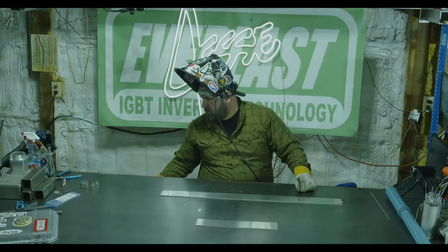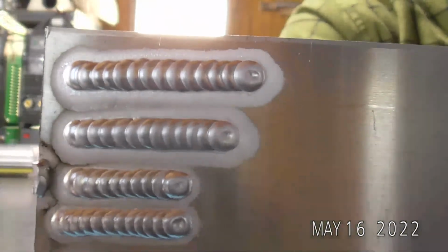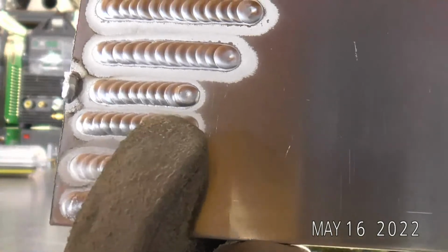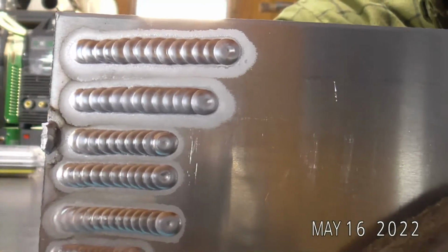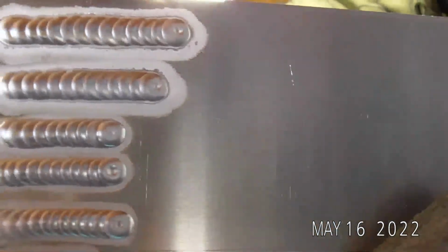So you can see how wide the etching is right off the bat. We're running the same exact settings. The only change is we went up in gas flow by about 2.5 times. So we can get back up on the up close cam. So you can see, I should have ran those a little bit further apart. You can see how much wider the etching zone is just from these 2 runs up to that higher gas flow run. So quite a bit of a difference there.